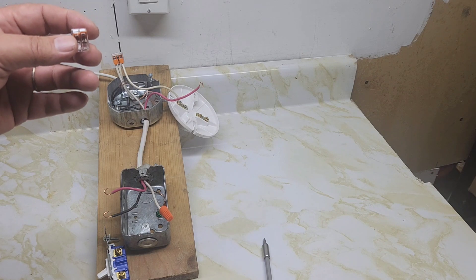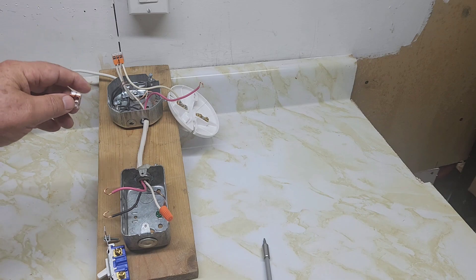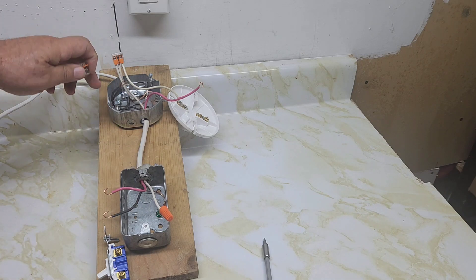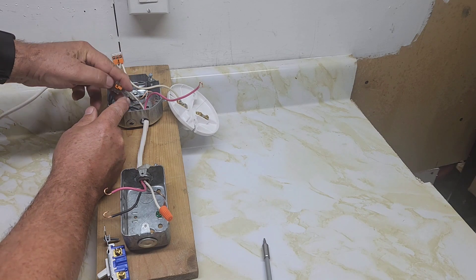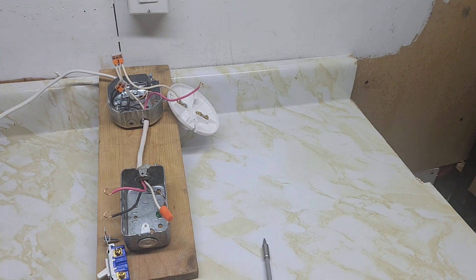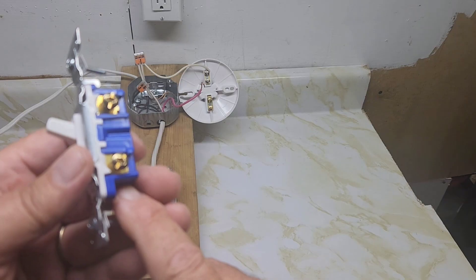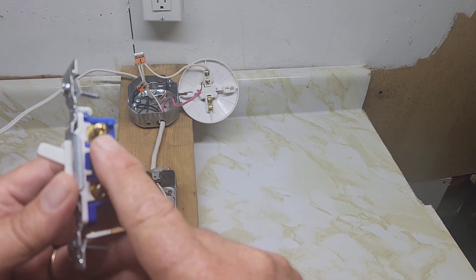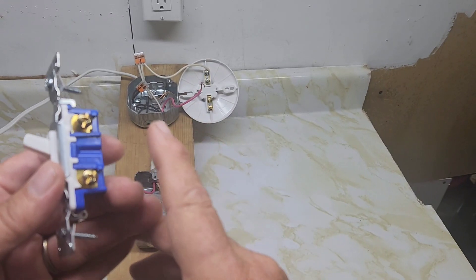The new code says you have to bring power to the switch and not leave the neutral unused. So the new code is: bring the power to the switch and back to the light. We've got power coming in and you're going to have a black wire going to the switch — connect those two black hot wires with a connector. Now you've got power going to your switch. The power coming from the octagon box goes to the bottom of the switch, you connect that, and then connect the red wire on the top of the switch and it goes to the gold terminal on the light to complete the circuit.